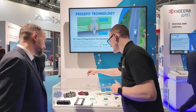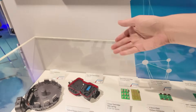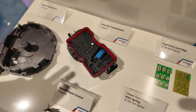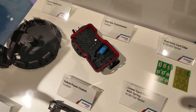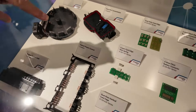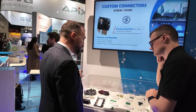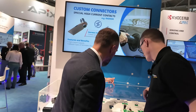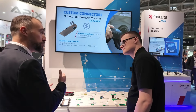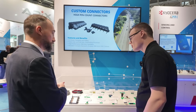Something that caught my eye is that capacitor inside the connector. That's what we call a mechatronic product — it's a 2K over-molding. We have the first over-molding stage of the contact and then a second over-molding stage to mold the gasket. The electrolytic capacitor is just pressed in via an IDC contact — you insert the wire or lead into a slot and create a cold joint, the same as PressFit.